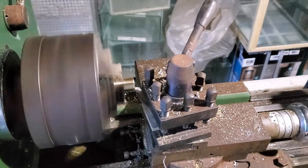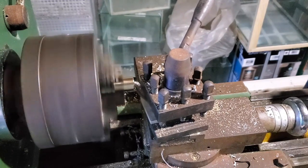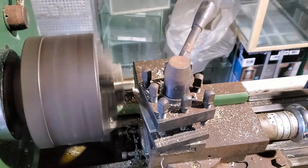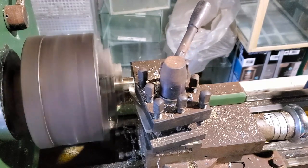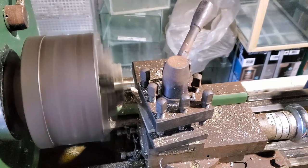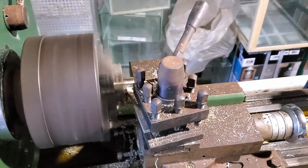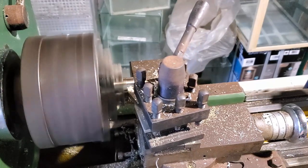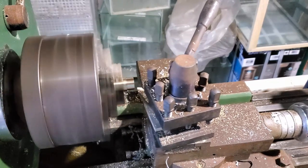This piston has to connect to the shaft that's going to run to the flywheel, so I need to turn that down to rough dimensions. The shaft so far is a piece of flat bar — it's half an inch wide and an eighth inch thick. This is actually relatively straightforward as far as turning goes, but what it will give me is a rough weight of the piston. The motor I've chosen has to be able to move two of these in the cylinder, so I need to start getting a feel for that. On each of these passes I'm taking off about half of what I took off before, because this is not critical — just to get it down to something I can feel.